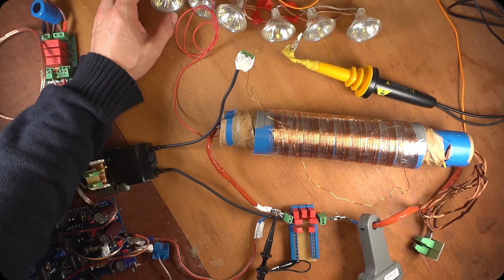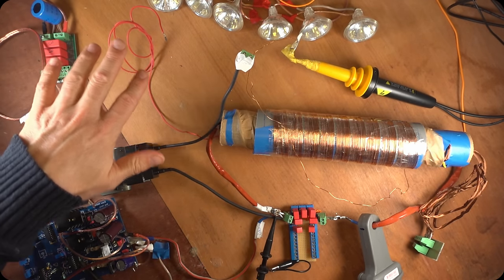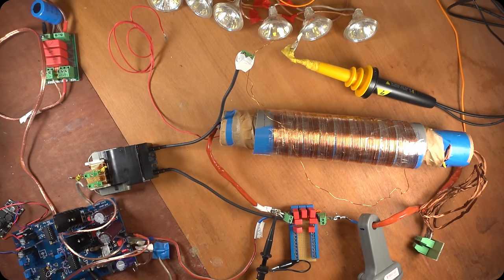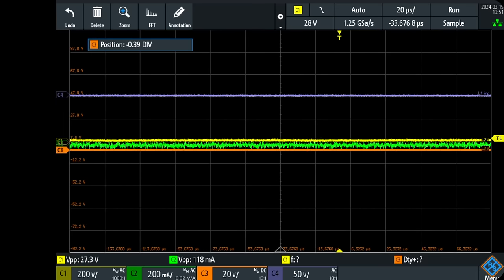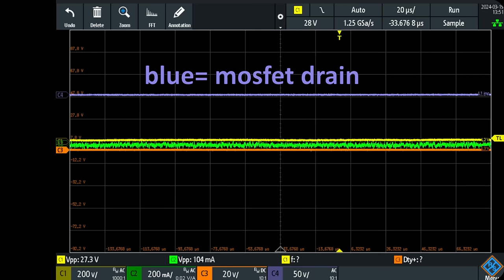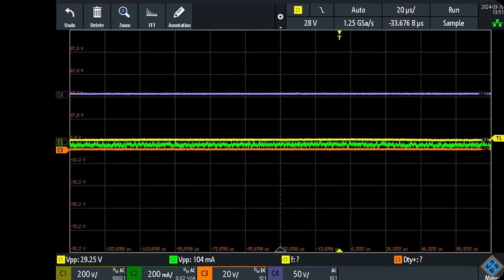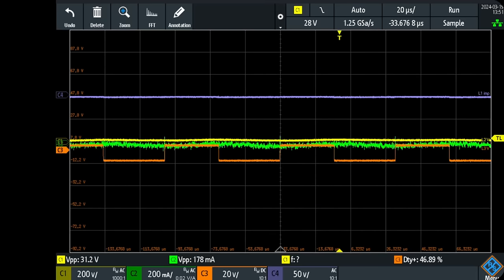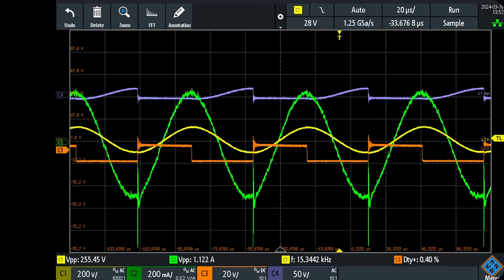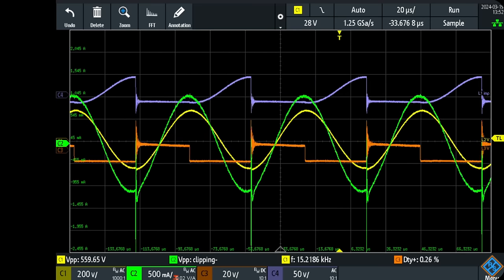I'll disconnect the load for now by simply removing the lead and keeping that just open. So the output coil is now open-ended and grounded on one side. We'll take a look at how this behaves right now without the load. Let's turn the system on. So if we take a look at the oscilloscope, we've got four traces corresponding with the probes. The blue is the drain of the MOSFET, the green is the current, the yellow is the high voltage coil, and the orange is the PCB where the gate signal is visible. Now we're going to turn the system on. You see the square wave in orange of the PCB gate signal — the MOSFET is already switching. Now I'm going to power it up with a little bit of voltage to see what's going to happen. And here we have some current and we have some voltage.